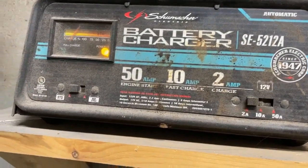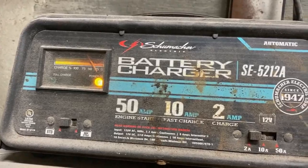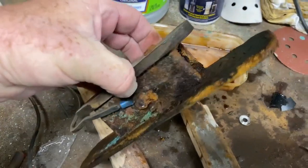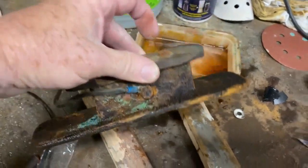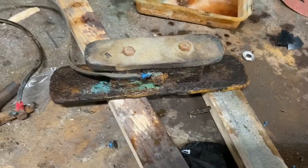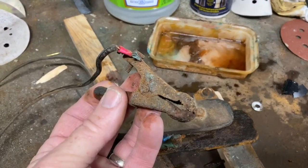I use a car battery charger — this is a 12-volt charger and I've got it set at 2 amps. You could certainly go out and buy an etching machine if you wanted to; any power source that can deliver 12 volts at 2 amps should work the same. This is my electro etching plate — it's just a flat piece of steel welded onto a piece of tubing, which I've drilled and tapped a couple of holes into. The negative lead from the car battery charger goes to that plate, and the positive lead goes to an alligator clip which gets clipped onto the blade blank.